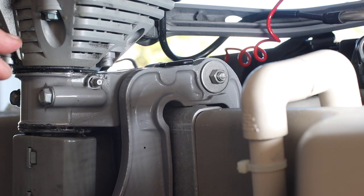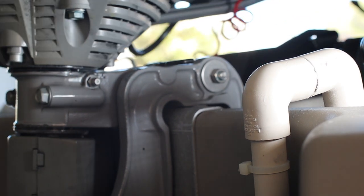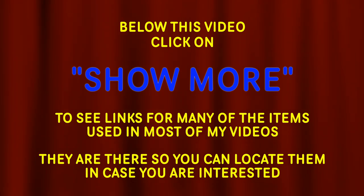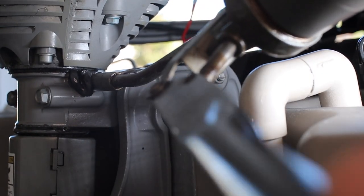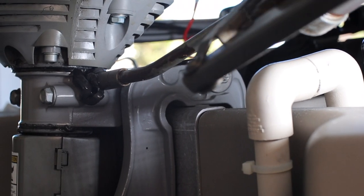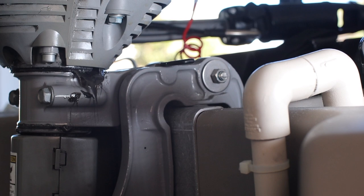Here's the Honda. While I have the grease gun out I'm going to grease this one grease fitting that's on the side of the motor here. That greases so that when this turns it gets the shaft cover grease. Below this video click on 'show more' to see links for many of the items used in most of my videos. You can see grease coming out from here. And you need that bin on the bottom to catch that because it makes a mess.